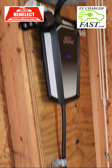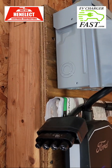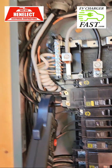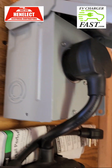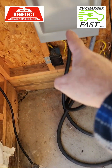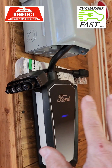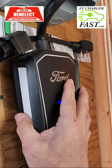However, the National Electric Code is not in your favor — the 2020 NEC adopted a rule that says all 125/250-volt receptacles, regardless of size, must be on a GFCI breaker. Because this unit is plugged in it has to be on a GFCI, which is counterintuitive because this wall connector has GFCI built in. If it were hardwired, no external GFCI would be required. We're going to do a GFCI test — it should trip the GFI in the wall connector.